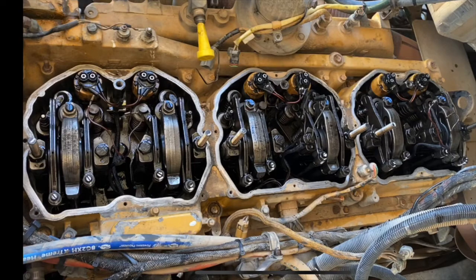That's all you've got to do to adjust the injector height on these injectors. Even if you don't get 180 degrees exactly right it's not the end of the world — it'll just run a bit rough. Obviously you want to get it right, and definitely take the injector down 2 turns and bring it back before you do the 180 degrees.